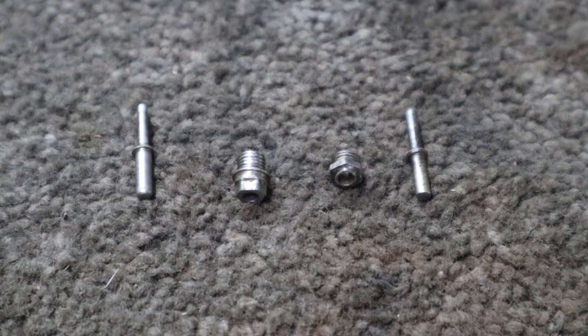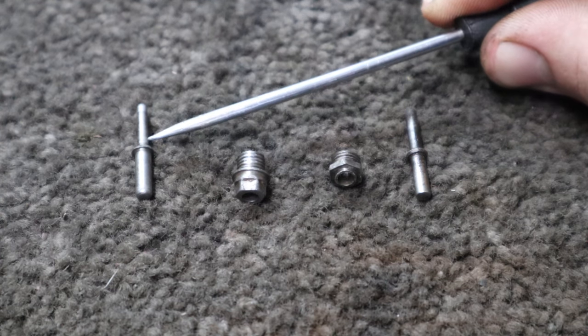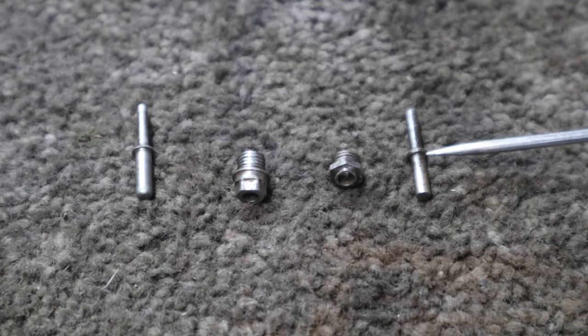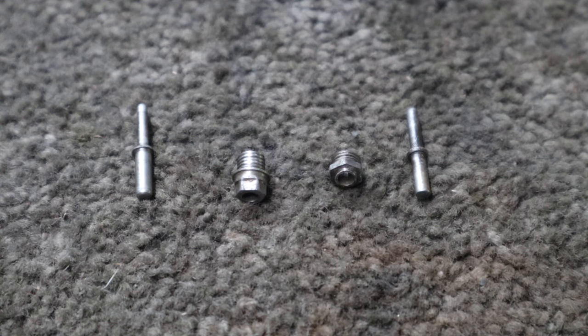These firing pins are different measurements. This firing pin will not fit in the original nipple, and this firing pin will not fit in this nipple. Now that's not completely uncommon for an old shotgun because a lot of stuff is fitted by hand — left with left, right with right. So potentially these firing pins are both originals. However, we have different collars on them. This one here is flat-based on the bottom and tapered forward; this one here is flat-based and actually domed — a slightly different form factor. They are almost the same length, but not quite. So it leads me to believe that potentially when this nipple was changed, this firing pin may have been changed.